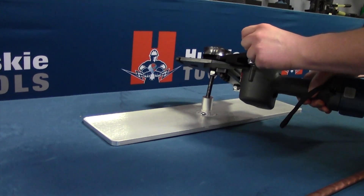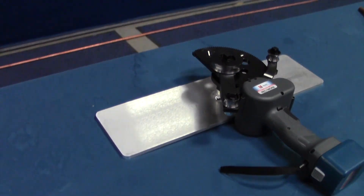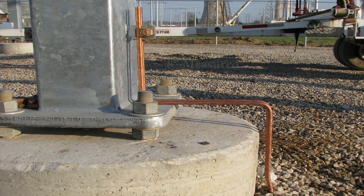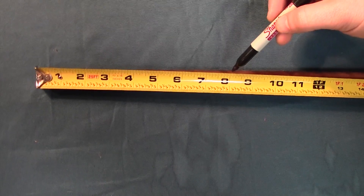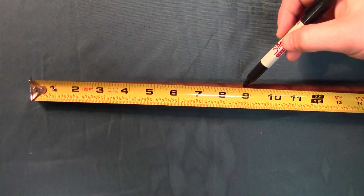Start by inserting the REC 54GRB into the stabilization plate. With a tape measure, measure the distance for the first bend. Then measure the ground rod, adding approximately three quarters of an inch, and make a mark.